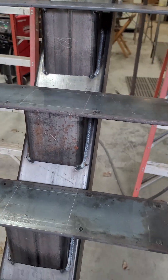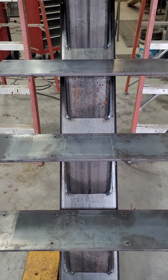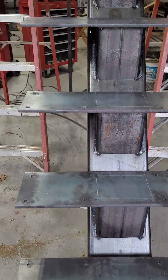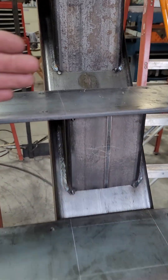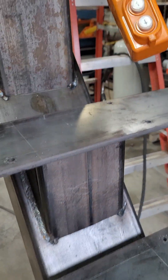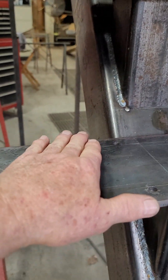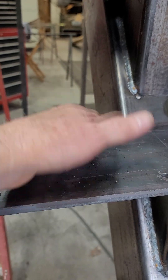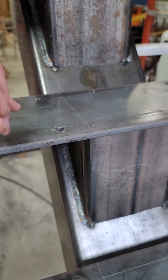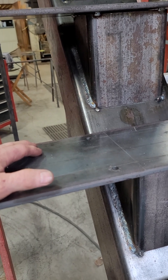Sometimes it's hard cutting these pedestals — you get a layer of variation every now and then. So I put the pedestals on, and when I lay the plate up there, I put two levels — one here and one over here — and make sure the tread is level this way first, then tack it. Depending on which way it needs to tilt, I'll weld the front or the back. Most of these I've had to lift just a little bit on the front to get it level.